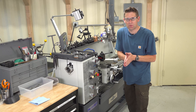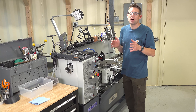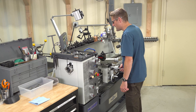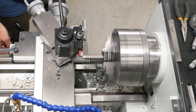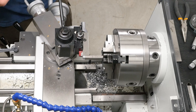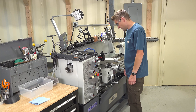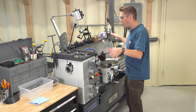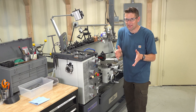Keep those hands out of danger. It might be tempting to rest your hands too close to rotating parts or in a place where they could get pinched. Always be mindful of the motion of the machine, and when in doubt, stop the spindle. Even if you're taking a precise cut, you can stop the machine, do whatever you need to do — remove chips, take a measurement — then continue. When in doubt, stop the spindle. Keep your hands well away from anything that's moving, anything that's going to pinch, hit, or suck you into the machine. It's better to be safe than sorry.